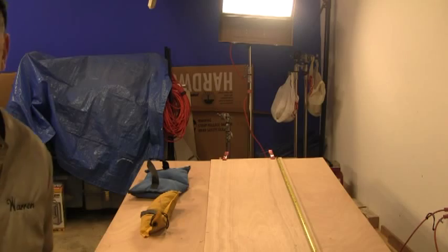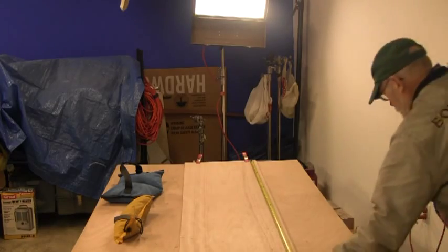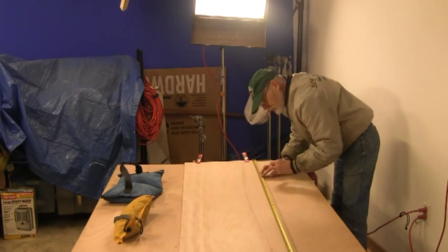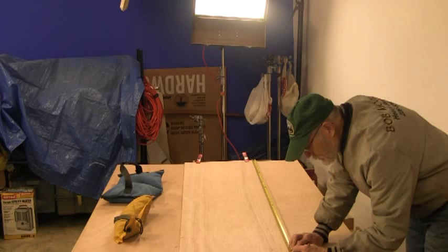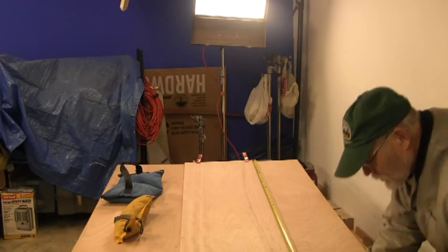The side panels are cut out and stacked and clamped in place. The critical time is when you're cutting out the two panels so that they're mirror images of each other. I've got them stacked anyway, so now what I'm going to do is start laying out the grid. I've got my ruler laid out hooked over the end and I'm going to go along at every 12 inches and put a little tick mark — seven is the last one.